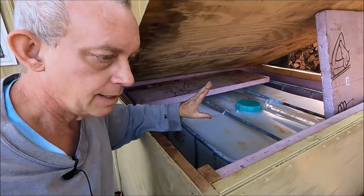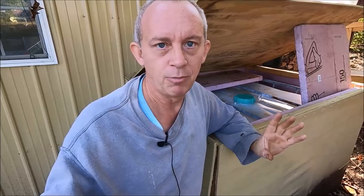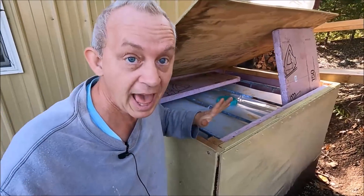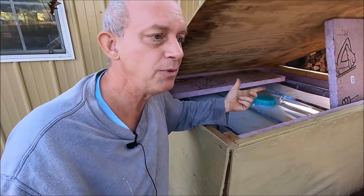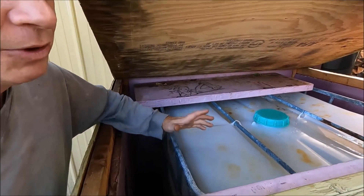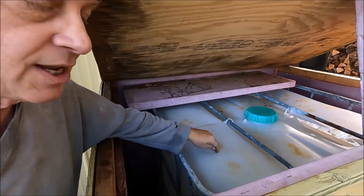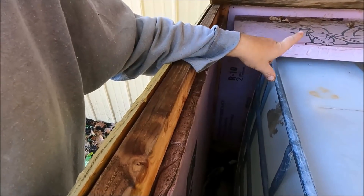Another thing I need to be prepared for is my water. Last year we did have a problem, though it wasn't serious. Every time I talk about the water freezing, people just hear 'freezing water' and come up with solutions that aren't really solutions. We moved in mid-January, and in February temperatures dropped to zero and below. The water tank itself didn't freeze until later. And even then, it didn't freeze solid. What froze was the plumbing — the water pump and the hose going into the house.